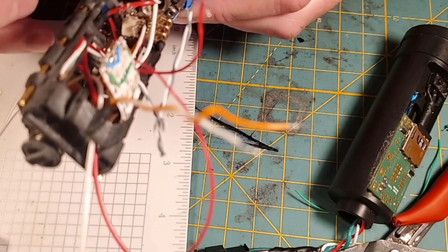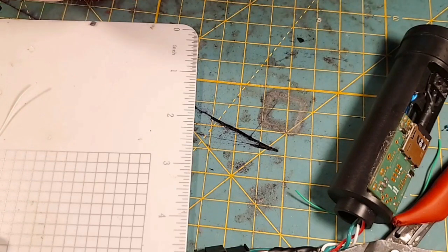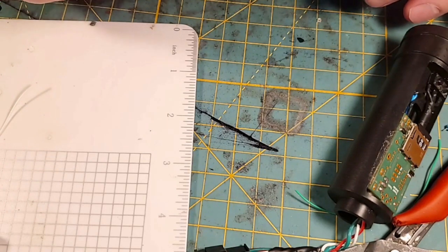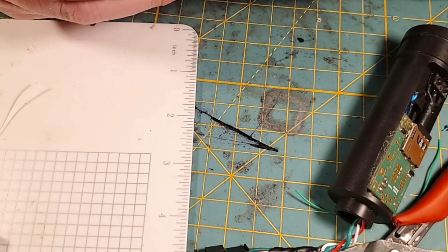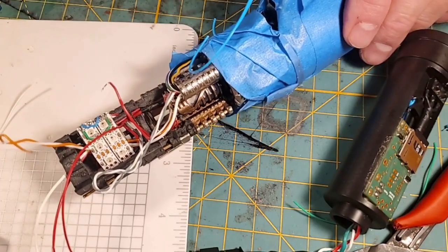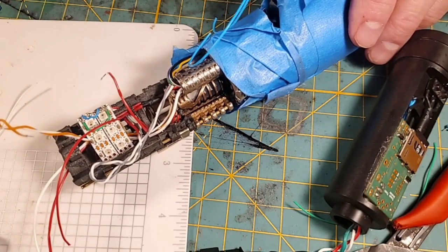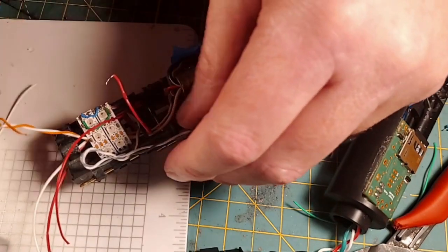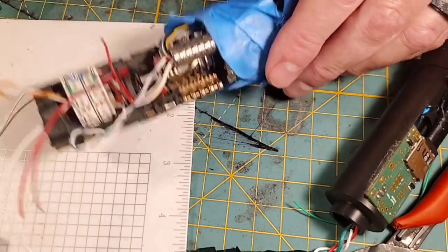The speaker wires, the Neopixel negative, the battery negative. Or no, that white wire is our common ground. Green and yellow switches. Brown is auxiliary data. Purple is main data. And the yellow is the auxiliary switch. So all our wires that need to go to the Proffieboard now exist in this chassis. And all I need to do is clean up this last merge. And we're ready to install the soundboard.